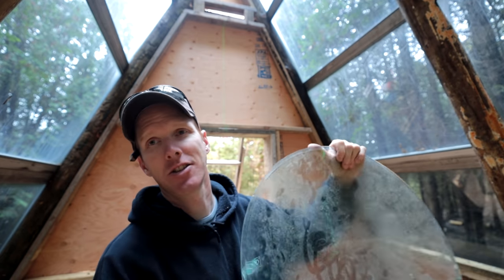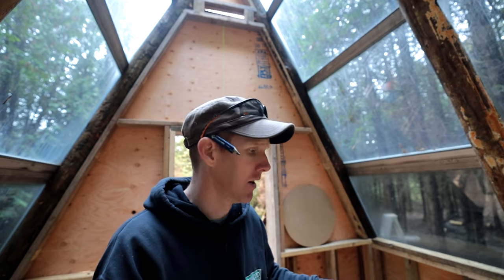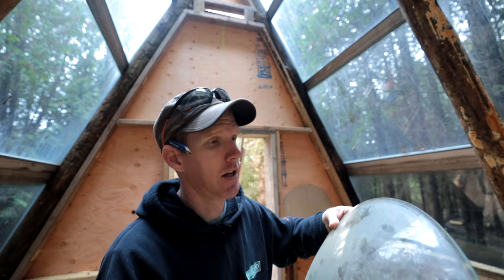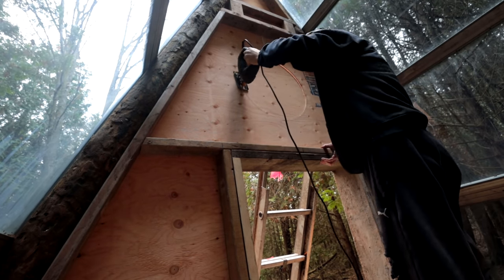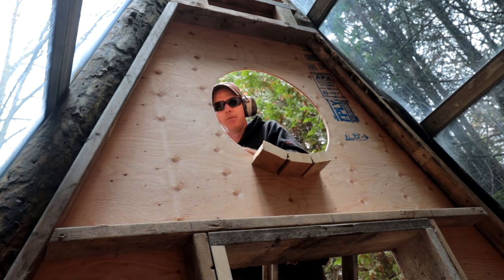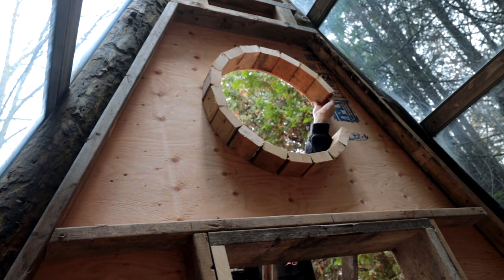I've got two left. This one here is actually the smaller version — the other circles I've put in are slightly larger. I want to put one in above the door. I've got my template all set up, I'm going to mark it out and cut it out. Once the circle is cut out, I cut a bunch of two-by-four blocks the thickness of my wall and skirted all the way around the circle to give myself structure and something to nail to when finishing on the inside.